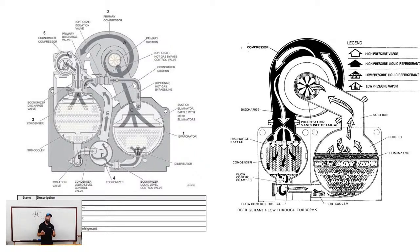It is for distribution, but the reason that's critical is those tubes specifically are sitting inside of a rack. And if that refrigerant level in the condenser is too low and it's not able to maintain above that plate, it creates a significant amount of turbulence that gets into those tubes and makes them rattle around. At that point, it is only a matter of time before they rattle enough to rub a hole somewhere, which you would see with eddy currents. Hopefully you're doing that and you would catch that ahead of time. Not everybody does, but that's a critical note.